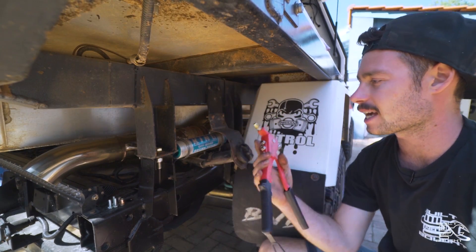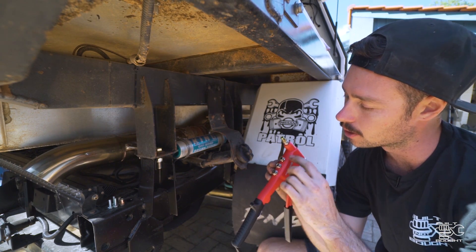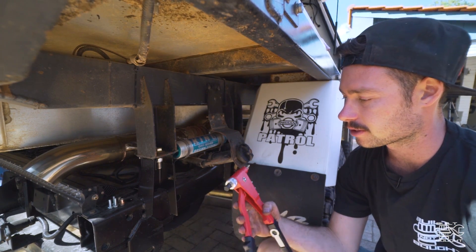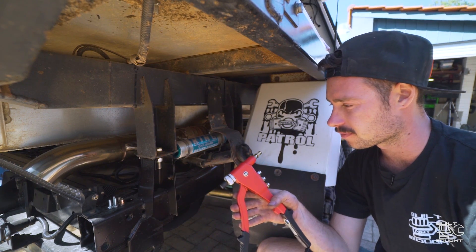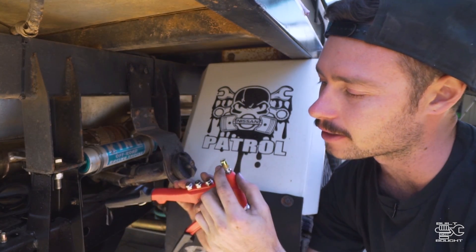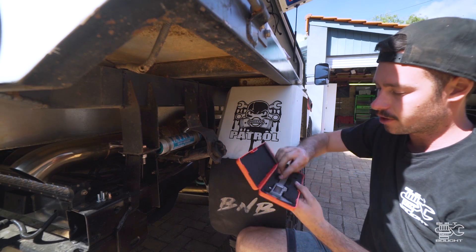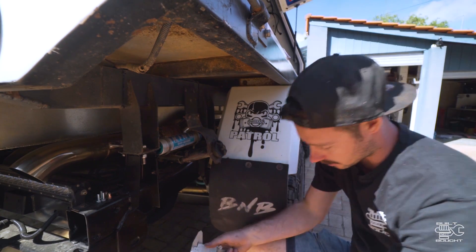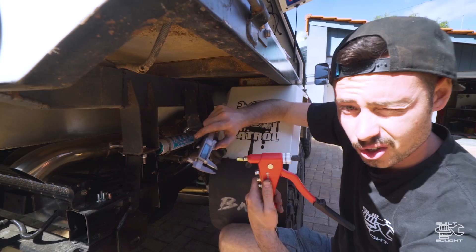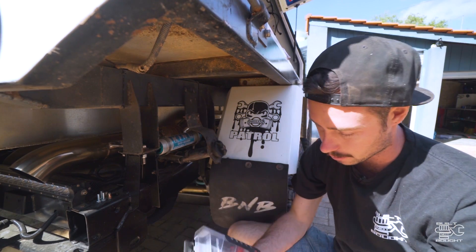What you've got to do is drill the holes to match. Each fitting on the end of this tool has written on it what size bolt is going in — so this is an M6. Actually, that's not quite how you do it. You want to measure the fitting that's going to go in there to determine the drill hole size. I've got a Vernier caliper — this will accurately measure what size things are. Measuring this fitting: 8.87mm, so I reckon a 9mm drill bit. Lucky I checked — the 8.5mm was actually missing.